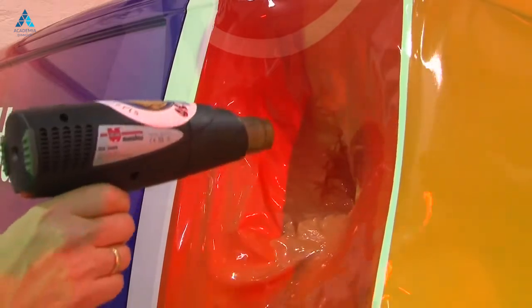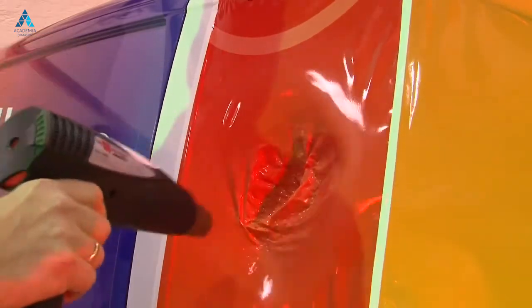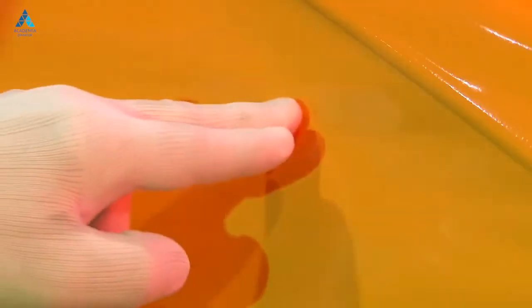Naturally, optimum conditioning is required. The correct temperature of between 50 and 60 degrees Celsius must be maintained, when processing in particular. To illustrate, see what happens here when the film is taken beyond its maximum elasticity at a temperature which is too low. The result can be stress whitening and a tearing of the film.